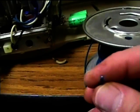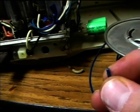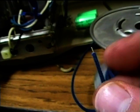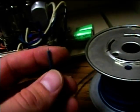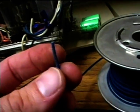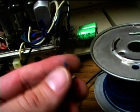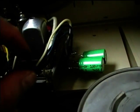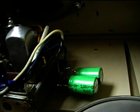You might be able to see here, there's a center insulating core that goes around the wire very tightly, and then an outer fabric cover, just like was used on tube type equipment from the 30s through the 50s. One of the best things about it is you can just push back the insulation. No stripping is needed. So it makes for a really neat appearance and easy wiring job. Plus it's well insulated for the kind of voltages you'd find in tube type circuits.